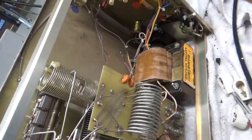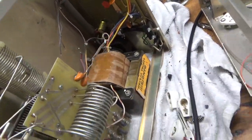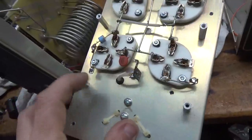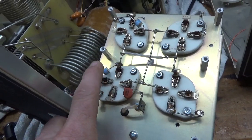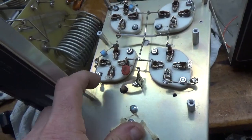I'm back with the tube socket assembly removed. Someone tried to ground the grids and did a really bad job. It's going through the strap and then through this wire over to the grid. They added the gas discharge tubes - I'll replace those. Poor solder work all over the place.